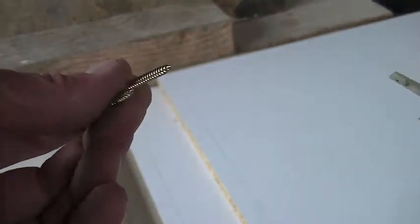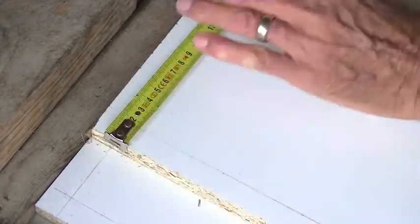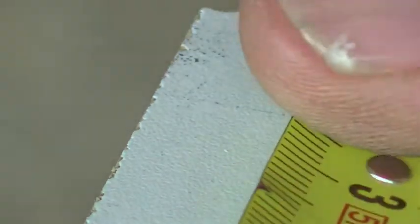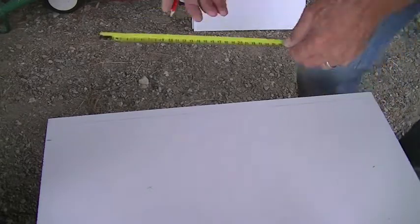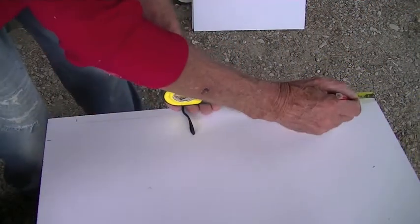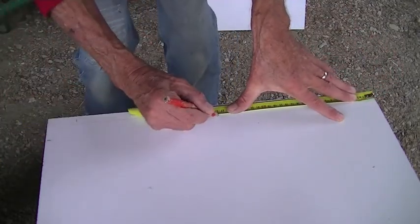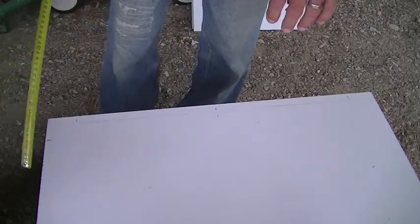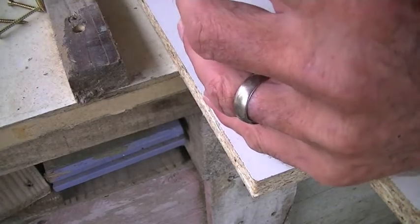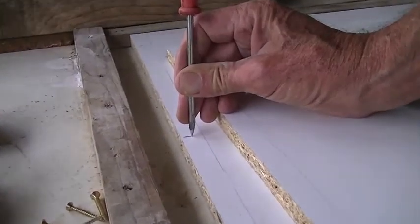The description is 3 by 30, where 3 is the diameter. I like to make the marks for my screws starting 5 centimeters from the top, another one 5 centimeters from the bottom, and along the bottom I'll also mark 5 centimeters from the corner, 5 centimeters from that side. This panel is 56, so I'll mark one in the middle — that's four at the back and three along the back. Then I go around to each mark with an awl and make a small hole right in the center so I know exactly where to screw.